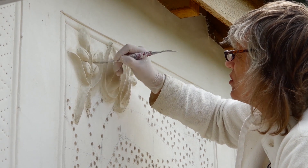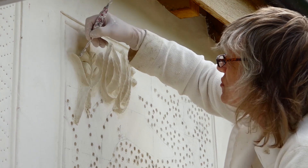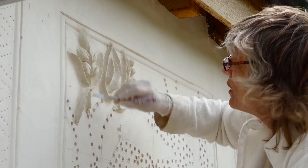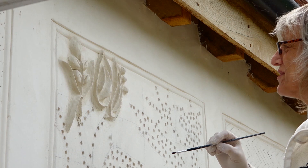The trouble with water is if it then freezes, it will blow the plaster because it expands when it freezes. So you need to spend a bit of time making sure the bond between your new parget and the parget behind is complete with no little gaps.